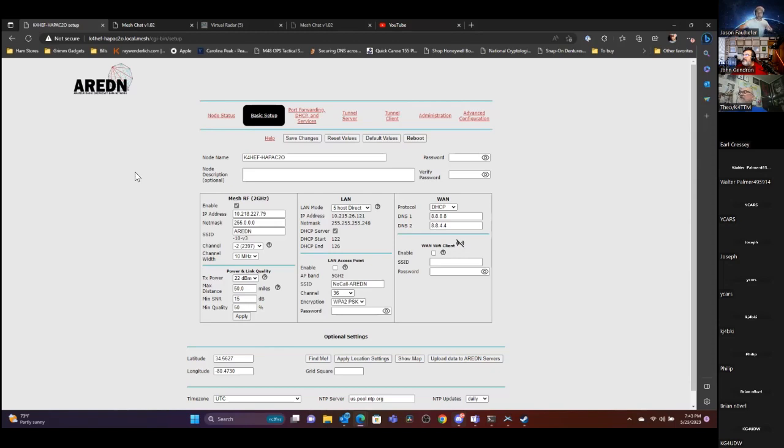I can ask a neighboring node to share their internet — there's a button in the interface to turn on internet sharing. By default, when planning a mesh network, repeater nodes will have internet sharing on, but at your house you may not want to enable it all the time because you don't want your bandwidth soaked up by other users. But basically, that's what AREDN provides: a way to get to the internet or distant nodes at broadband speeds.